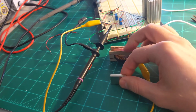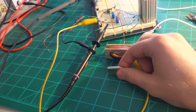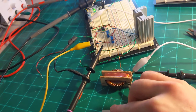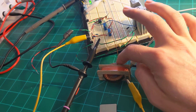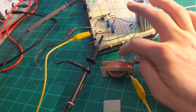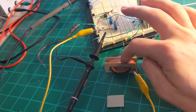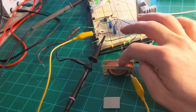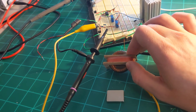And why that is, is because when the magnet gets closer to this core, it starts to increase the level of saturation of the core, which means more current is being drawn through the primary. That extra current is greater than the extra current that comes out of this coil due to the static magnetic field. So there is no positive gain, unfortunately. Maybe there is some other type of configuration that would work.